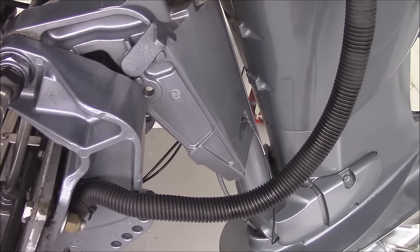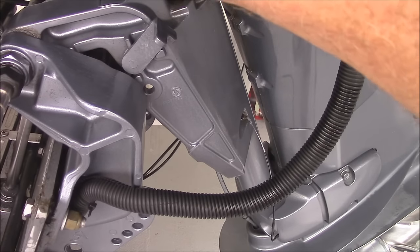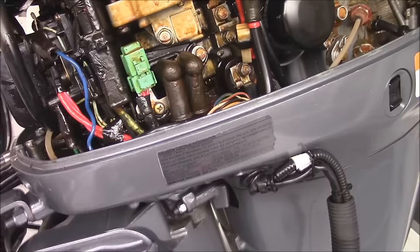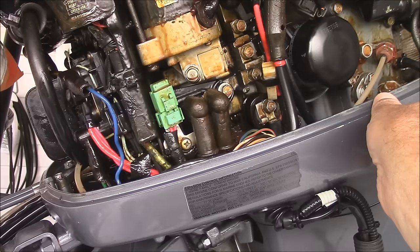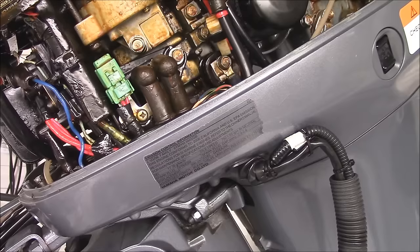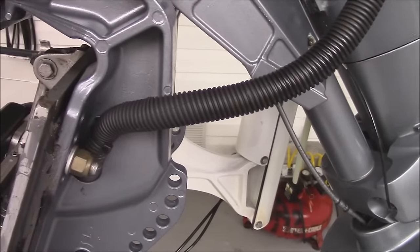If when you hook up the green wire it doesn't lower down, it could be the bushings. I didn't have to get to that point. From what I understand, if the trim tilt did work when you disconnected the wires, that would tell you it's probably the relay. After doing some research and talking to a few people, they were telling me that if the engine gets almost all the way up to the top and just starts sounding like it's dying and gets stuck, it's low on fluid. I figured out that's exactly what happened here.